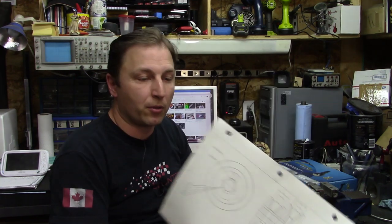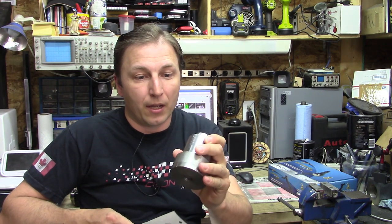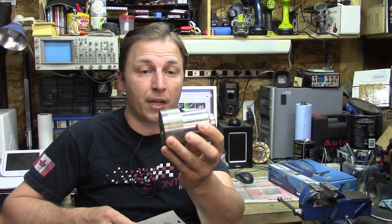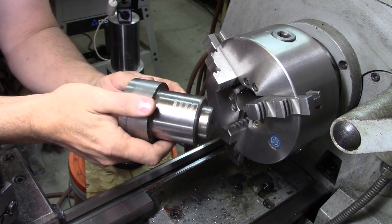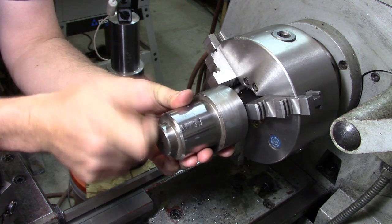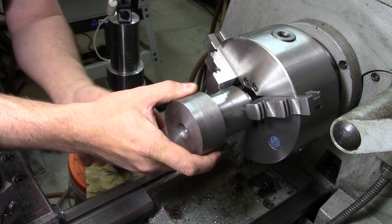I also needed a piece of material. A lump of scrap from the bin will let me get my double pulley out of it. Holding it is going to be a little bit of a trick, but we'll figure out a way to do it. If I were starting with a larger piece of stock, I would probably hold it by the bigger end in the chuck and work the other end first. It's going to be a little bit awkward as far as working around it and machining it, but this is the way we're going to have to do it.